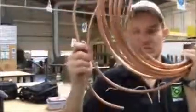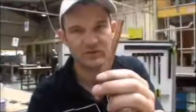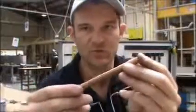I've cut a short piece off a coil of copper pipe — this is a coil of soft copper, 8mm. In a real scenario you'd probably use it to connect something like a small heater. Obviously it's not a big pipe so you don't get a huge volume of gas through, but a small space heater coming off a galv main or even a pex main, which is the type of plastic used for gas as well.